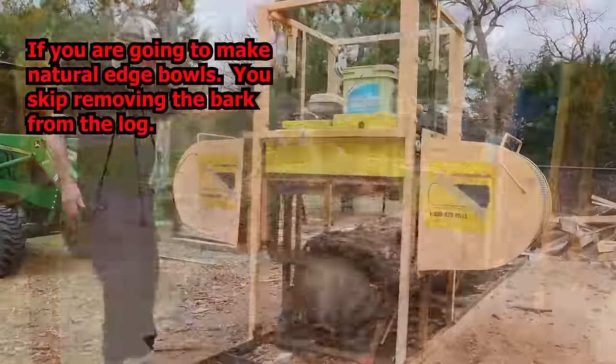All right, we've laid out our bowl blanks and saved our best wood. The next thing we're gonna do is take a chainsaw and just cut these loose. Chainsaw cut. Chainsaw cut. Chainsaw cut. Chainsaw cut. Sometimes you have to go back to the other end and start and work this way, but just get a plan of how you want your chainsaw cuts to be and then just lay them out and try to save these odd pieces of wood as much as you can. Sometimes it's not stable because there's no real way to cut them out of there, but it should be.